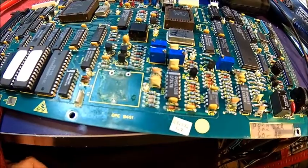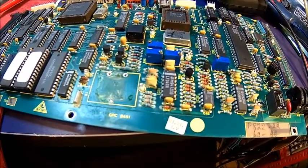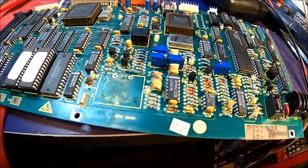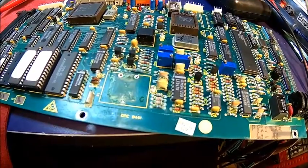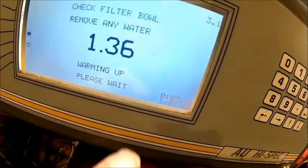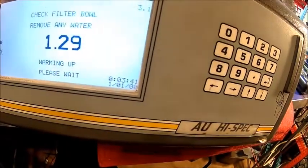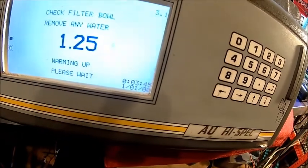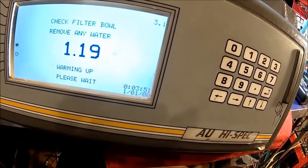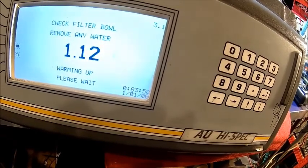I don't have a 3.6V cell but I can make one up — I've got some single cells. I might make a three-cell pack. I just looked into my battery collection and don't have something that fits right now. It's definitely the memory battery because the date has just reset, the time as well. We need to do something with this battery — maybe it stores some calibration values, I don't know. Interestingly the voltage raised to 5.1V, so maybe the dead battery was draining too much current.